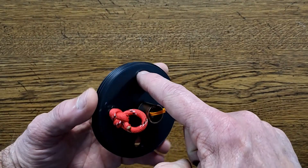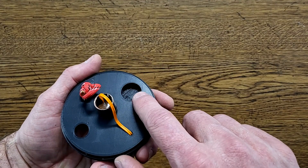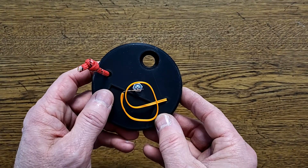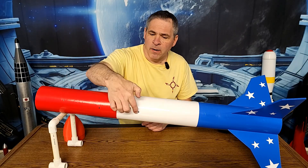This indented area here is just a finger hole to assist in installing and removing the base from the nose cone. When the base is printed, there are some thin supports in this area that can easily be removed. And finally, we have this large hole here — it's smaller on one side and larger on the other. This is a vent hole. The flight computer measures barometric pressure to determine altitude, so the flight computer needs to be vented to the outside of the rocket. This vent hole in the base vents the flight computer chamber down into the upper portion of the rocket body, and then there are several small holes in the rocket body to vent to the outside.